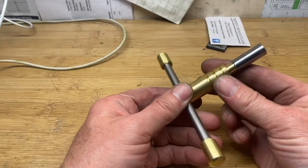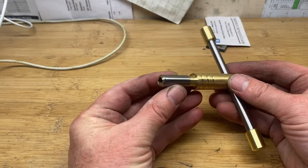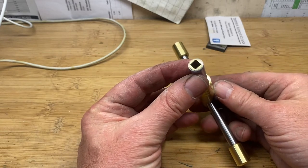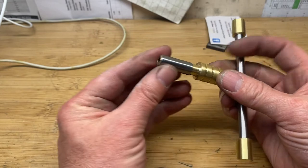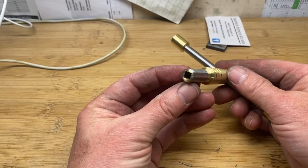Here you can see what I did: I put a steel sleeve around the end. This was heated up a little bit and then hammered on, so it's got a press fit. It'll hold everything extremely strong — I've got a brass core with that steel sleeve to hold it together when you really put some torque on it. Hope you enjoyed this; if so, please subscribe and leave any comments.